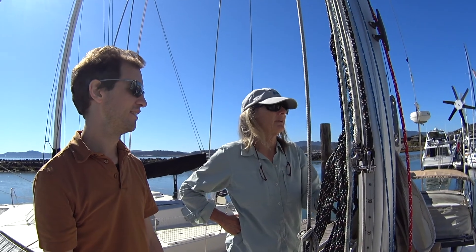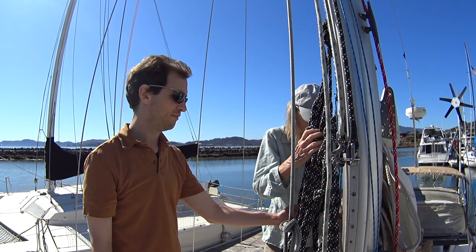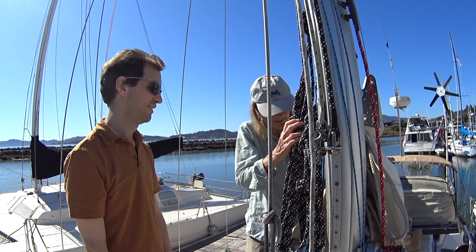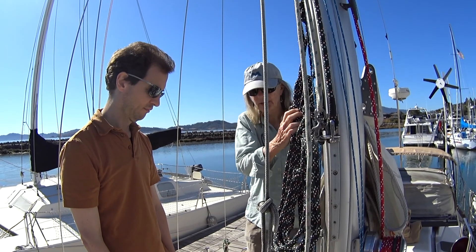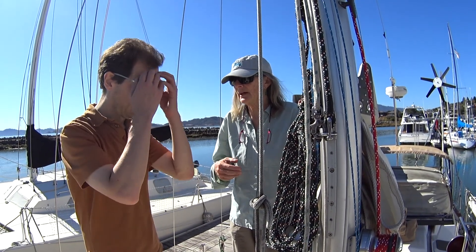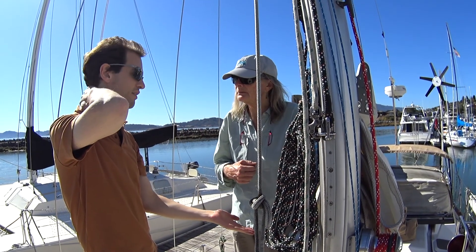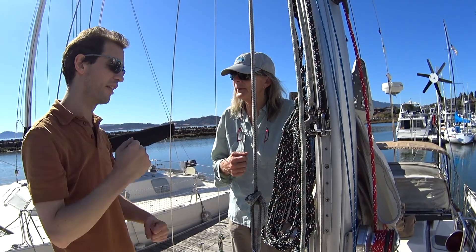We might want to talk at lunch about whether or not to put a trysail in the mix. I think a nice thing is that ability to reef from the cockpit if you can pull it off, but it does involve having the main halyard and the reef tack and the reef clew lines all back in the cockpit — that's a lot of lines to lead aft. It did have single-line reefing, but I just found that to be challenging — it didn't work as well, a lot of friction.